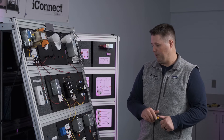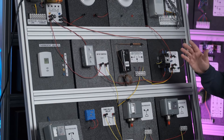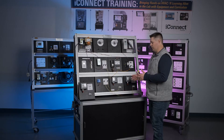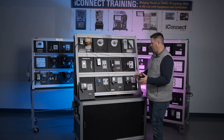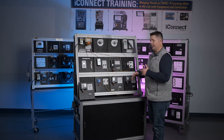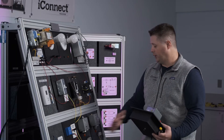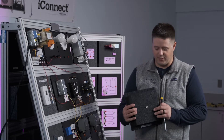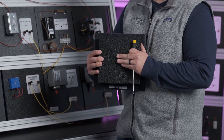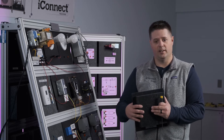Some of the components have a bug switch on the back of them, which allows us to turn the circuit off — acting as if there's a problem with the circuit, so it kind of functions as a troubleshooting tool. The high pressure switch and the low pressure switch — the commercial-grade ones — have a toggle button on the back that, when toggled, opens the circuit so that the component trips out.